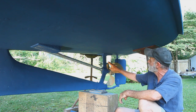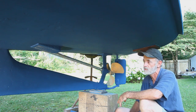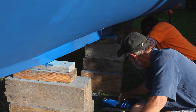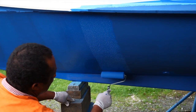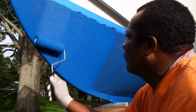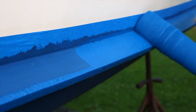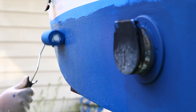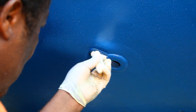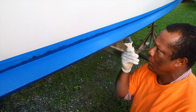I've painted out the strut, the rudder, and a few other things a second time at the end of the first coat, so those have got two coats on them now. I'm applying the paint fairly liberally because you have to get a firm coat on there otherwise it's not going to do its job - you're trying to keep sea growth off the boat so it will move along nicely. The first coat took about a quart, maybe just a little over. This one might go on a little thinner, so we'll probably use about half a gallon total for the entire job on this 22-foot Tripper Angler.